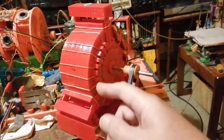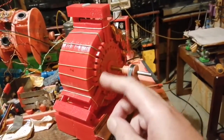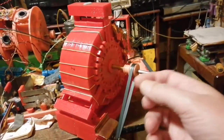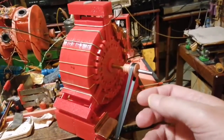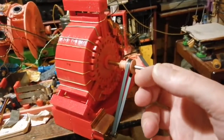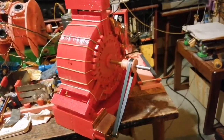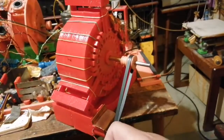I positioned it slightly. It's not got a coil on it anyway, but the reason for having them all on is to reduce air drag, because when it's a sealed unit and they're spinning, the air is actually circulating around with the rotor, and it's not replenishing with static air, which is also a drag issue. As you know, with an electric fan, the blades draw in static air and then propel it. Well, that actually slows the fan down, obviously. So by enclosing the rotor in the canopies, there's less air being drawn in and less air being pushed out, so there's less drag in that respect.